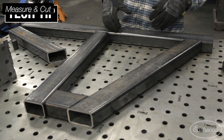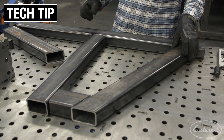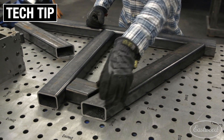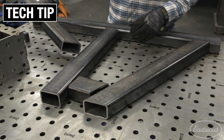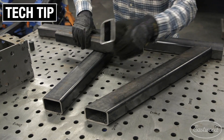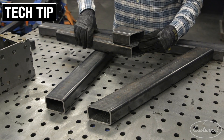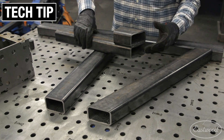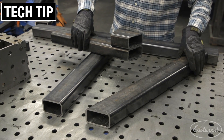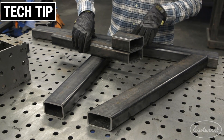So here's a tech tip. When you're making mitered cuts like this, it's best to set your angle once and make all of your cuts. So we actually cut our one structural support here and our upright. We then also are going to make the other support from the same cut that we did the first time, and then we know they're actually going to be the same angle. That's a nice little tip. Also while we've got it set up, we're going to cut this piece, then we'll go back, set it up to a 90-degree cut, and make the rest of the cuts we need to do.